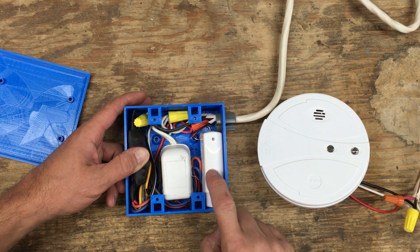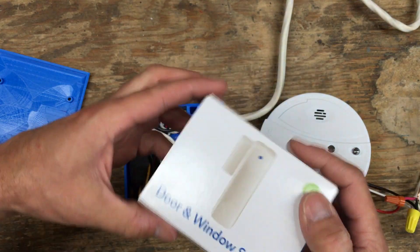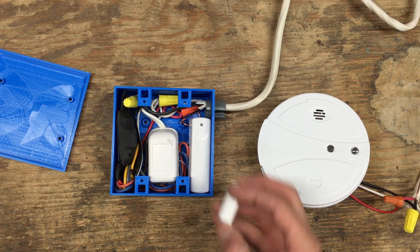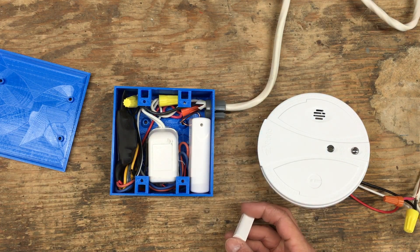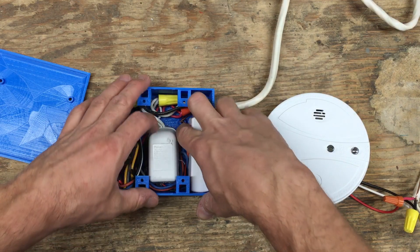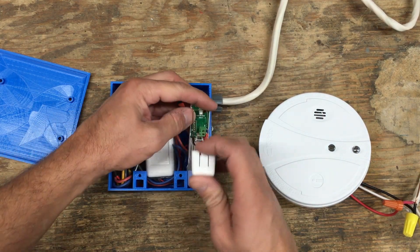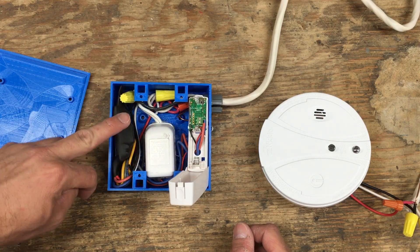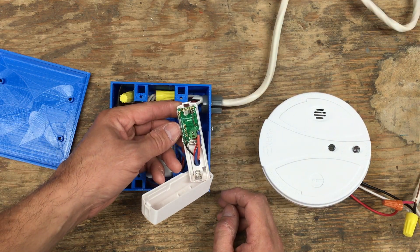I hooked it up to this right here, which is just an EchoLink Z-wave door and window sensor. This is a normal sensor that you normally put close to a door or a window — you have a little magnet that goes on the door itself, and when the door gets closed it triggers the relay inside. What's cool about this particular EchoLink one — I'll put the links in the description — is that you can wire directly to some terminals. Inside you have those two terminals, and when you short those terminals the sensor gets triggered. So I hooked up the relay from the SM-120X to the terminals of the sensor.